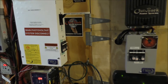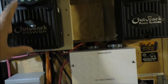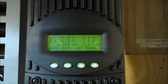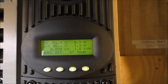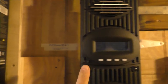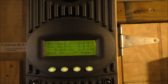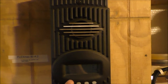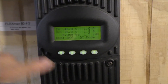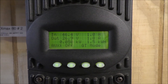Here's the kind of power we're making — 104 watts right now at six o'clock in the afternoon. This is the bigger array, the new 1,060-watt array, bringing in 50 watts. The Montana Solar array — also 1,060 watts — made 2.3 kilowatt-hours today and is bringing in 60 watts. These are all Outback FlexMax 80 MPPT charge controllers. The flatter array on the roof brought in 1.5 kilowatt-hours today and is bringing in 50 watts right now.